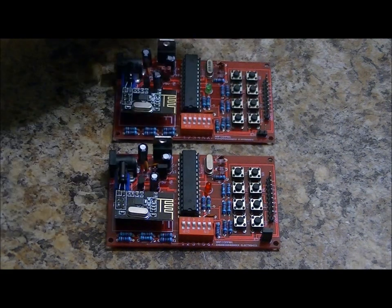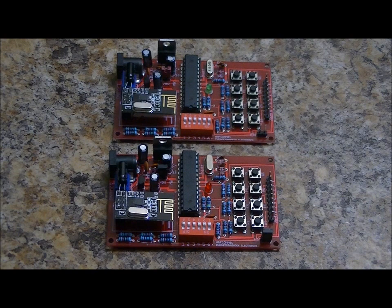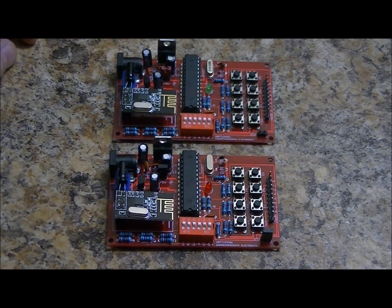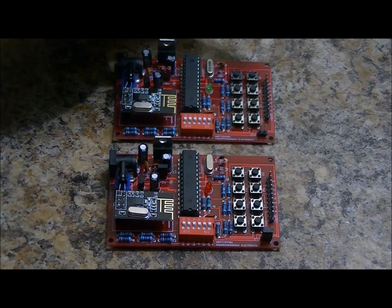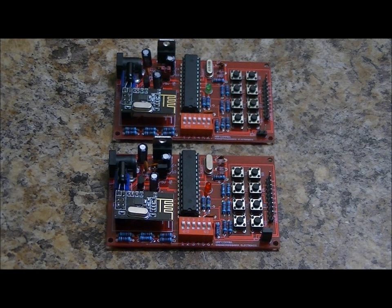We've got 8 buttons. We've got an output rail. The output rail can be used on the transmitter side to apply logic to transmit. Alternately, you can use the buttons. On the receiver side, the pin headers act as an output. So what we can do is have up to 64 transmitters transmitting toward one hub receiver.